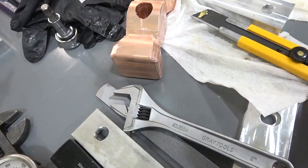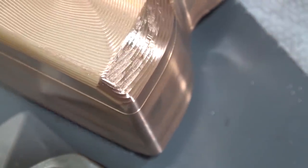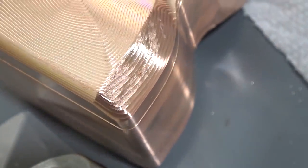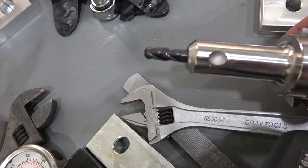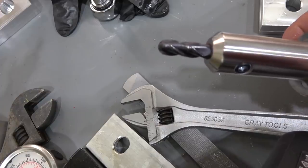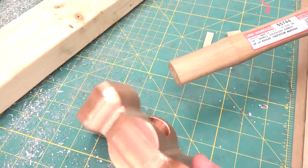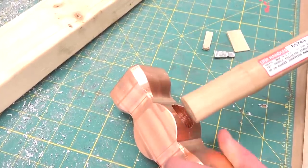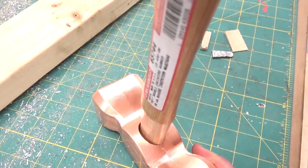She's all galled up here. Let's have a look at that — pretty fine looking fingerprint until you get over here and she rubbed one out. There's the bastard. It's a four-flute so it likely picked up something and then flung it off eventually. I'll have to get a three-flute. Let's see how she hangs with a genuine lick of the hickory stick — put her in the big end. I think that'll be just fine.